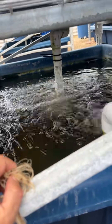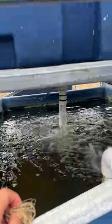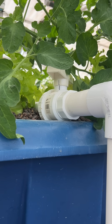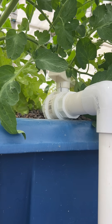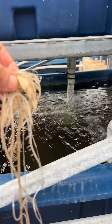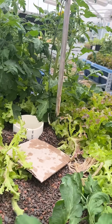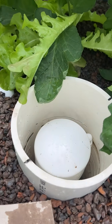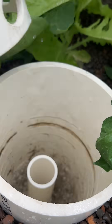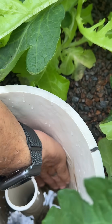Found the solution. See, that's how it should drain. It wasn't the issue of the flow being too slow or too fast, or the water flow overpowering the siphon — it was these roots that got into the siphon compartment. When I removed it, I found all these roots.